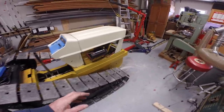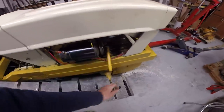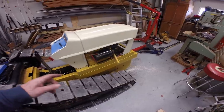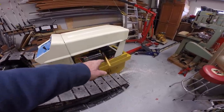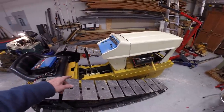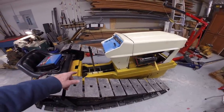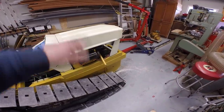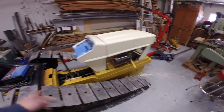The tensioning and detensioning of the belt to allow starting worked fine. I think the idea is to start it standing next to it with the belt disengaged, get the engine running, get into the operator's seat, and then engage that tensioner so the belt turns the transmissions.